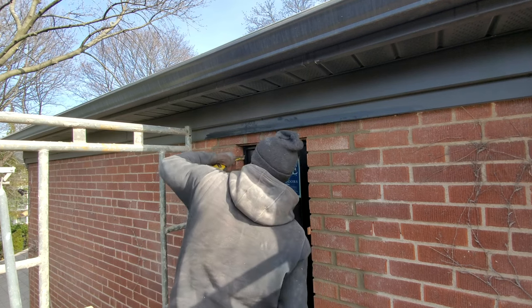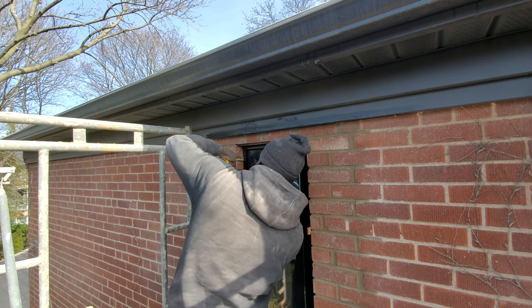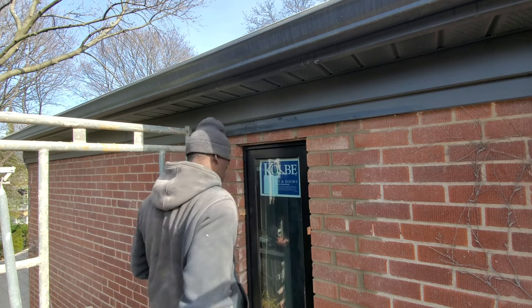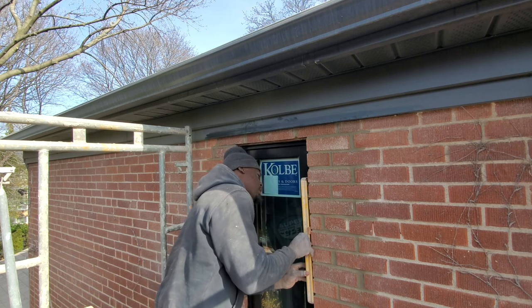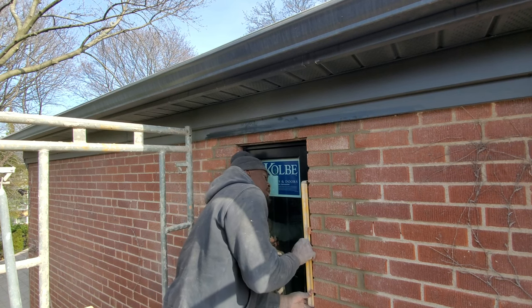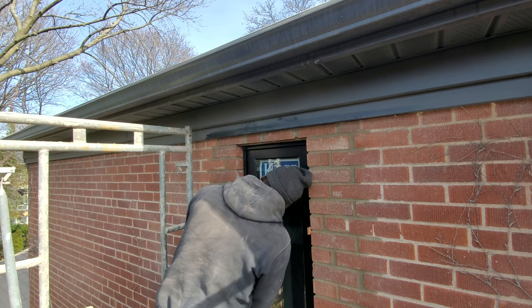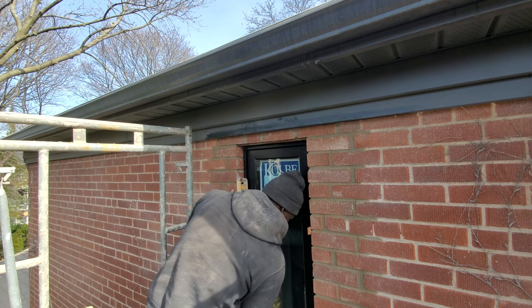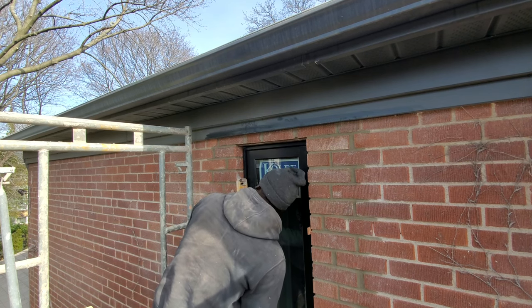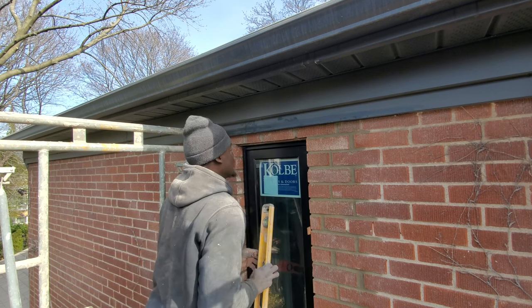Two and a half. Knock this side into me a little bit. Over here. Alright, okay. Let me check now for plumb. The top wants to come out to me a little bit. That's what she's telling me. The top of it wants to come out, or we can knock the bottom in. Either one. Okay. Right there is where she's plumb.